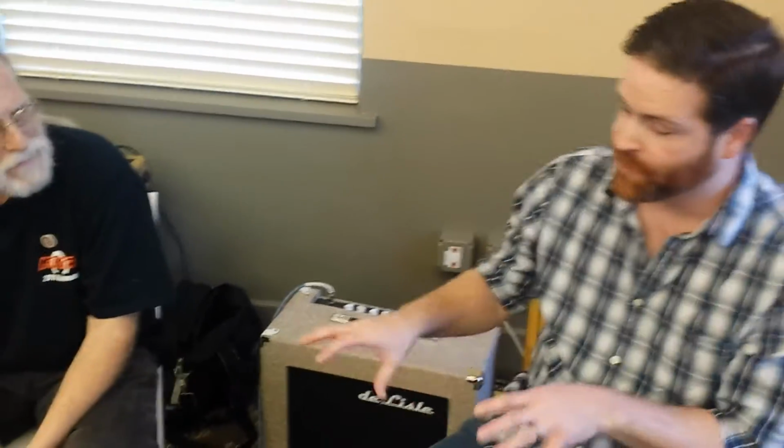Oh yeah. The first thing that I did was just move to a larger cabinet, because then I think you get a clearer picture of what you're actually dealing with as far as the circuitry is concerned. And then you know, those simple amps can have some great tones like a champ. You know, I mean, they're great recording amps, but guys are playing in their room and they want something that sounds like a real full sounding amplifier. And it can be done with pretty low power. You get a nice deep low end response from a big cabinet and a 12-inch speaker. So those were the things that I focused on first.